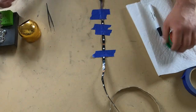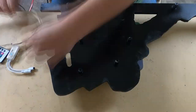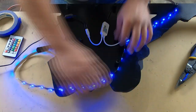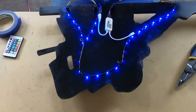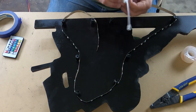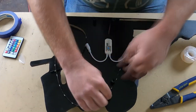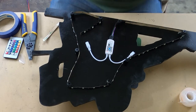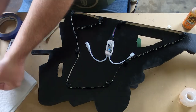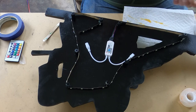I figured why not add some LEDs, so I soldered up my connector to an LED strip, making sure everything's nicely lined up, and soldering those wires onto the strip. Whenever you solder, test and make sure it works. I'm basically using friction and a little bit of tape to hold everything together, taped the connectors with electrical tape so nothing shorts out. Double-sided tape worked best for keeping everything where I wanted it. If you want to use glue, try hot glue instead.